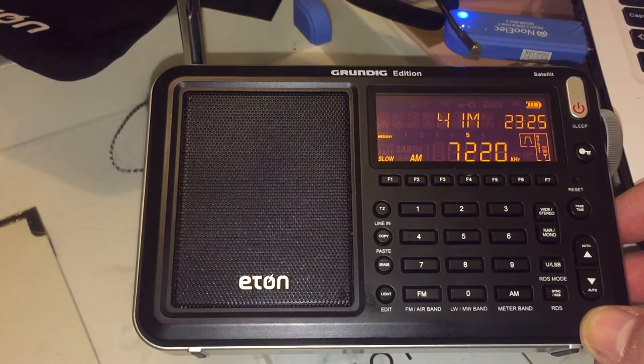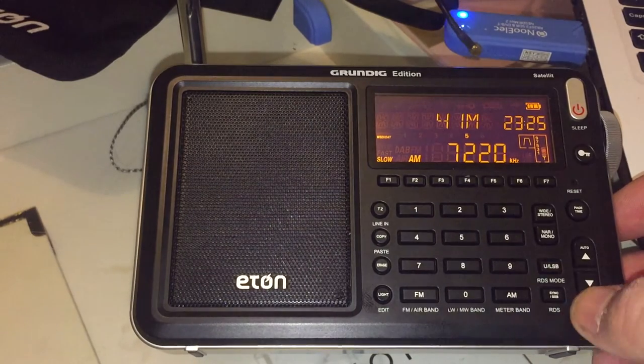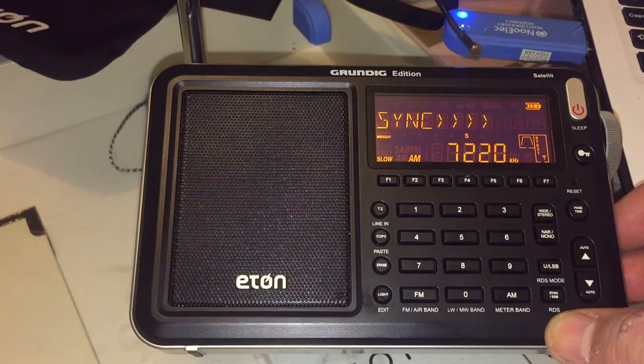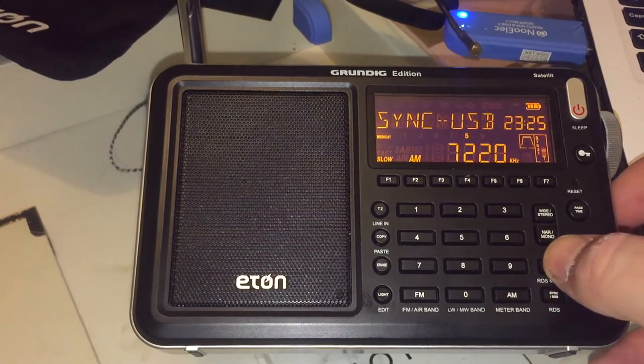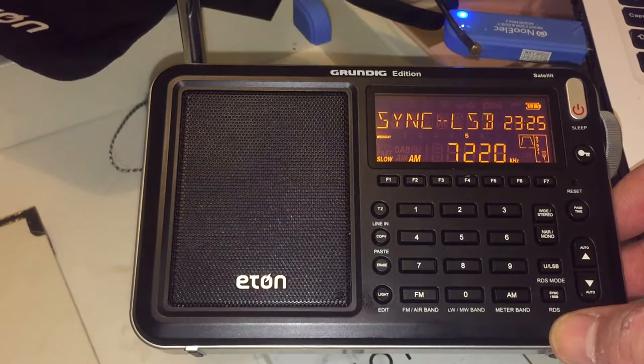In terms of the sync, and I made this point in my article yesterday, it's a bit more of a hit and miss affair. If I engage sync now, on this relatively strong signal, there the chevrons appear while the sync engages, and so now we have sync upper sideband, and I'm not convinced that that's a clearer signal necessarily. We can press the button again and select lower sideband,